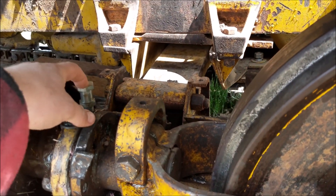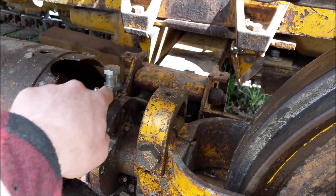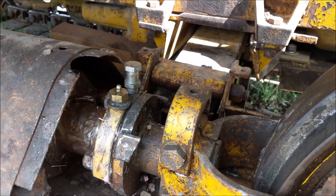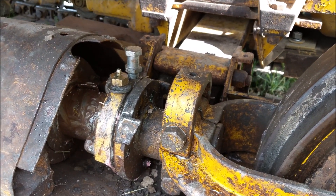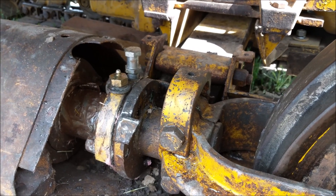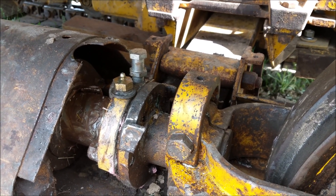What I'm going to do is loosen the bleeder and bleed the pressure off. Normally there's a guard on here to keep you from being able to remove these while on the machine — you've got to take the front piece off before you can take these out. They were really dangerous originally; you could take these out under pressure and it probably killed a few people. They redesigned the bleeder and put the guard on it. A lot of guys end up cutting these off — as you can see, this one's been cut off. I don't recommend that, so if yours is on there, leave it on there.